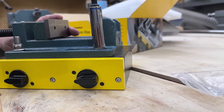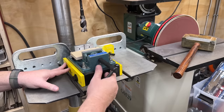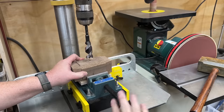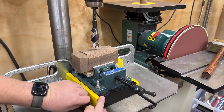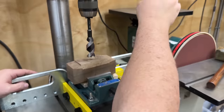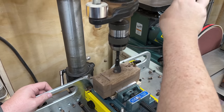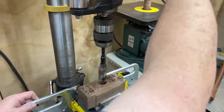If you have any questions, just leave them in the comments section down below and I can probably answer those for you. Now that we have the vise base in place, I'll go ahead and position it like we were doing before — just take a few seconds to line this up about where I want. Then I'll secure it in the vise, double check it again, make sure it's exactly where I want it, and then bam — I turn the magnets on, there's magnets on both sides, and it locks it down. Their magnet's so strong I could probably pick up my drill press. It literally takes one second to spin those switches and lock it down, rock solid.